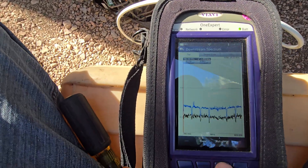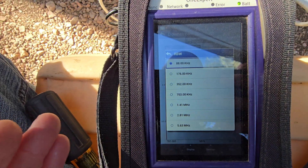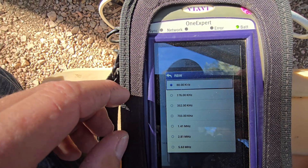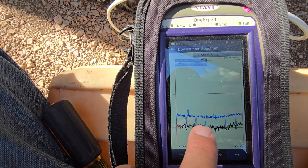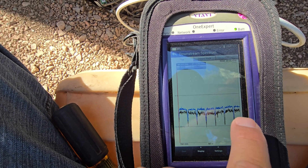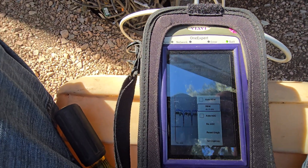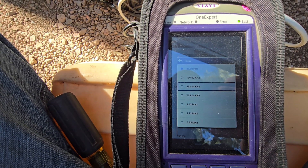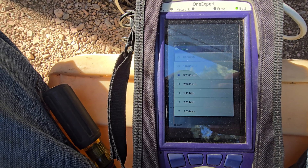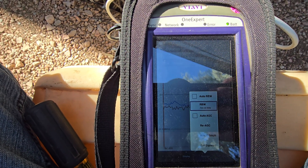One other thing to point out: go to the settings and turn off your auto resolution bandwidth. Once you set your max and min — if it's a smaller section like I have here from 780 to 820 — there is an option for 88 kilohertz. You want to go on that lowest setting. That way you can see better resolution on your signal leakage. I can see little V's that separate each of these channels — each one is a separate channel of our cable signal leaking out. If you change the resolution bandwidth to 352 or 703, it's not quite as pronounced and just looks like a noise floor. So that's why I use the lowest setting.